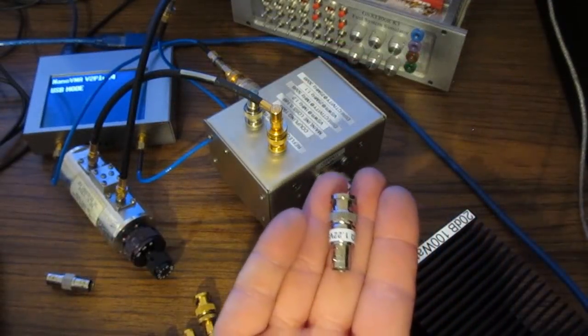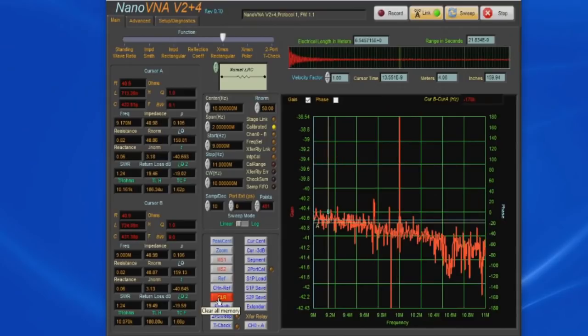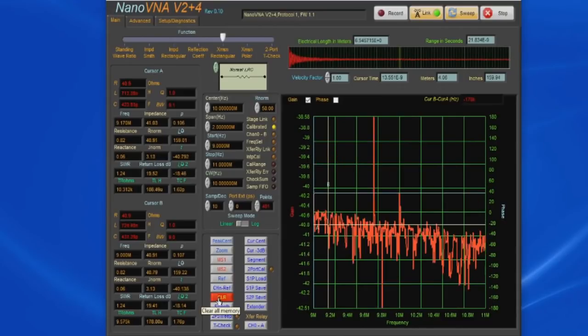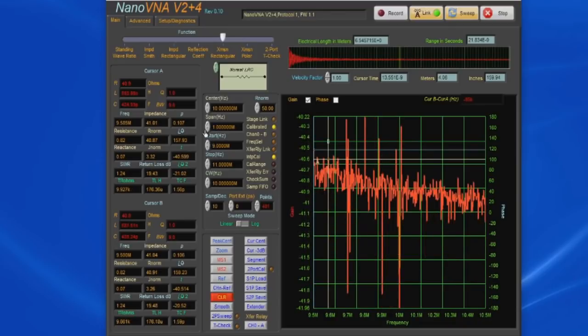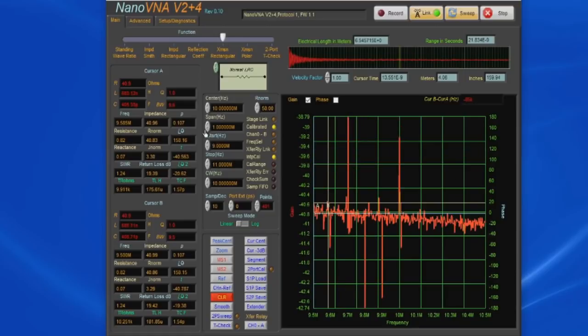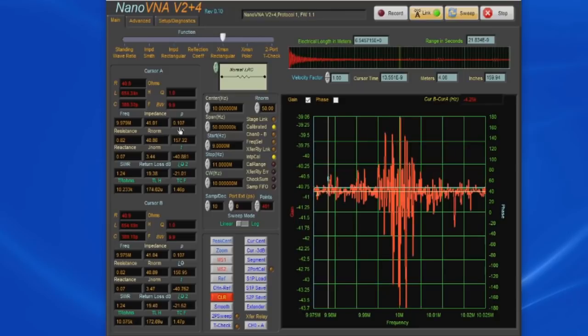Now let's go ahead and add our disturbance. And you can definitely see the disturbance from our signal generator. Let's go ahead and zoom in on this a little bit. So I'm going to change the span to 1 megahertz. And again, our software is now showing that we're using interpolated data. Let's take it into 50 kilohertz. And now we can really see this interference. Let's just go ahead and store that.